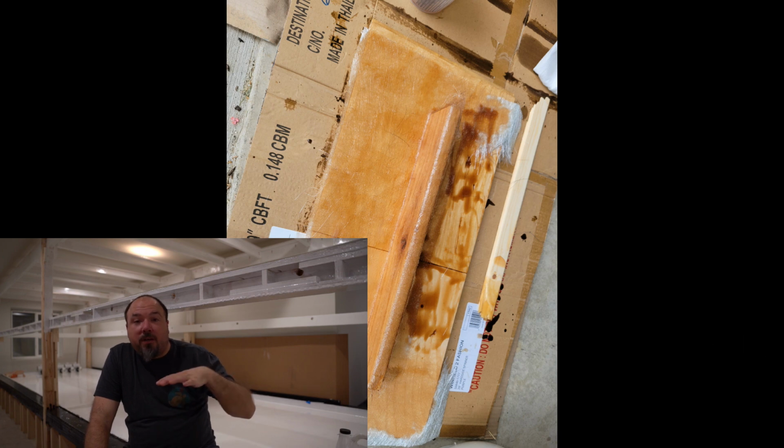After applying that resin to the wood, I had all my fiberglass pieces staged up, starting with the chop strand matte fiberglass. I applied that layer to the bottom test piece. Worked wonderfully. As it was applied, I went ahead and used fiberglass rollers to just roll out bubbles. Again, a real basic tool, works really well.